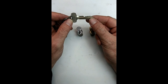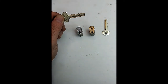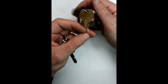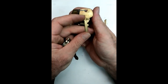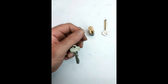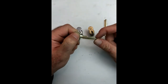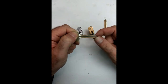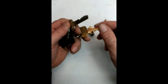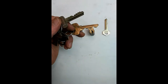The other fun thing about small format interchangeable cores is that you have to read the key from the tip to the bow. On normal keys, the key is read from the bow to the tip. So when you see a bitting number on the back — for example, seven, three, eight, six, nine, four — that's read bow to tip. Whereas on an IC key, you start at the tip and go one, two, three, four, five. This has to do with the fact that there's no key stop on the IC key. On normal keys, the key stop is where the key hits the barrel, which is how the cylinder knows where the pins are in relation to the cuts.